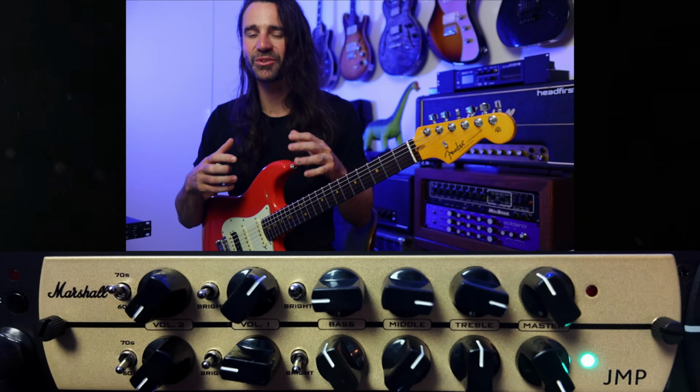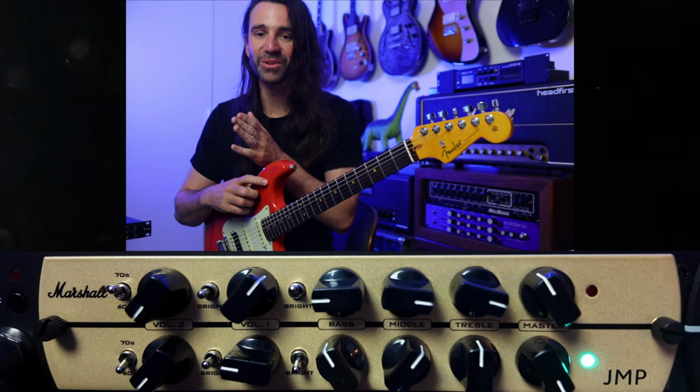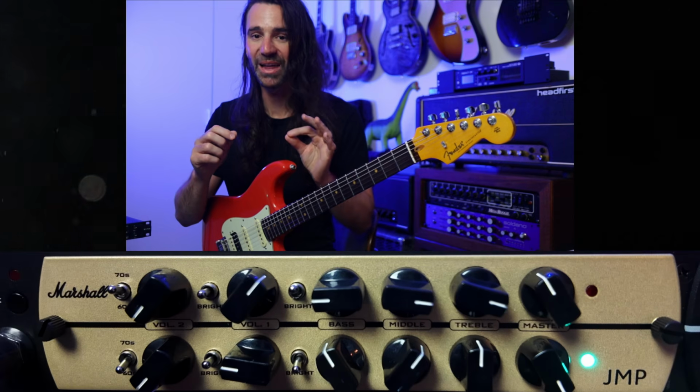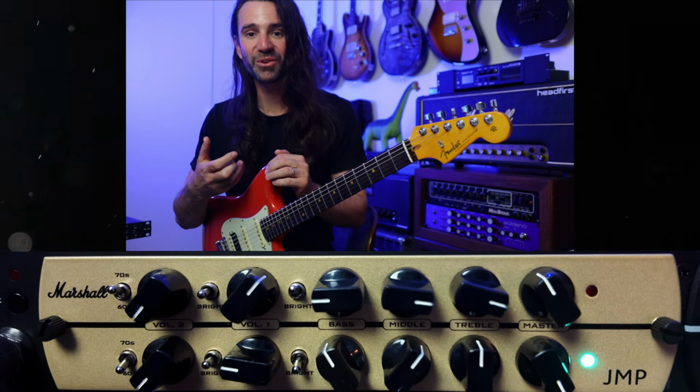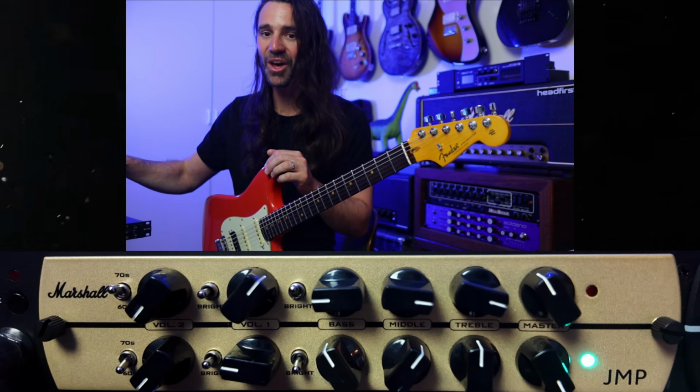I've always found with those stock amps that when you turn the volume down, channel 1 is too bright, channel 2 is too dark. So you could jumper them and try to blend those on there. Another common mod you could do to the amps would be to clip the bright cap on there. And you can kind of do all of these things on the module.